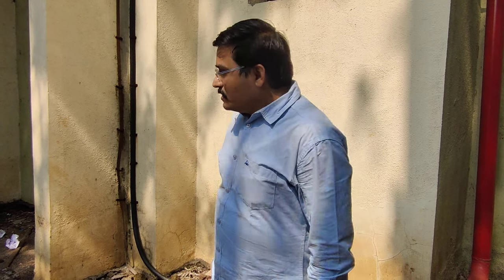Good afternoon, welcome to my channel. Today we are going to learn the practical of earth testing. We know that earthing is very important and essential in electrical engineering. Theoretically, we learn that earthing resistance should be less than 5 ohms as per IEEE standards and IE standard rule number 90. Today we are going to learn practically how earth resistance is to be measured.